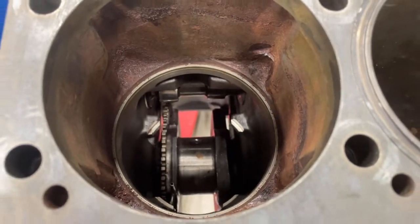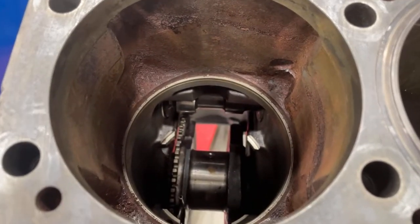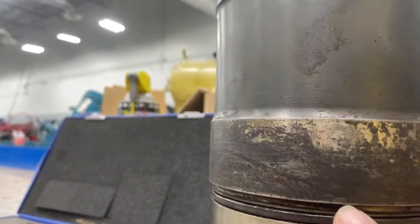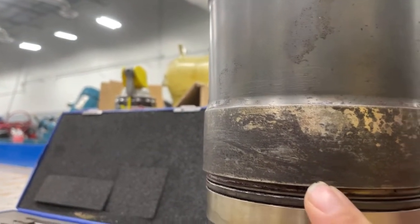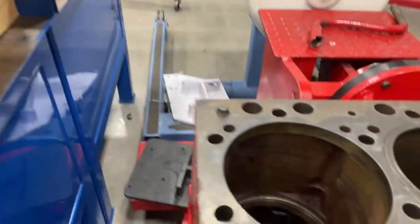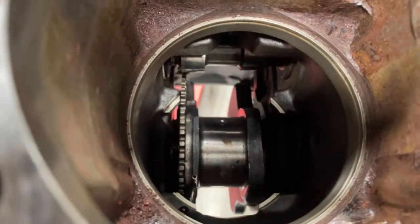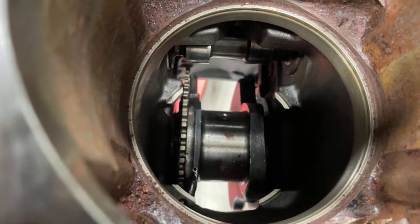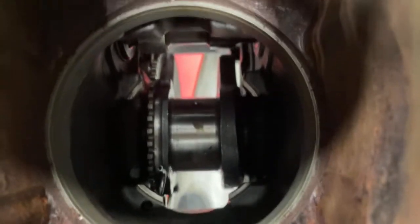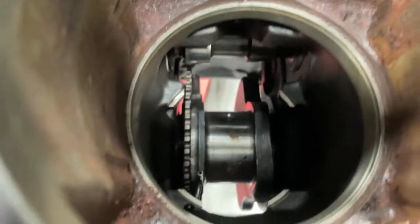The reason we're looking at this is that the part of the sleeve just above the O-ring is what sits on that ledge, so you can see why if the ledge wasn't straight the sleeve would be crooked. The first thing you want to do before taking this measurement is make sure that ledge is thoroughly cleaned off. There's some debris in this one — you would never want to measure with that on there because we're talking thousandths of inches of tolerance, and just a little bit of contamination can throw the measurement off. It needs to be very, very clean before you measure.